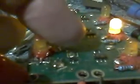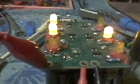I also found out that there was a bad MOSFET in this cheap Chinese balancing board. So I took the MOSFET out because it doesn't matter anyway, because I'm using my LEDs to balance the cells. I just took that MOSFET off the board because it was shorted out. I don't know how that happened, but you know what it's like. You buy stuff from China and it's sometimes recycled junk. I think this was a recycled circuit board. I think they just cleaned it up, because the solder jobs on some of these parts look pretty crap. They look like they've been used before. Looks like somebody's used components and made a new board.